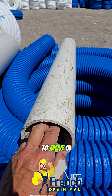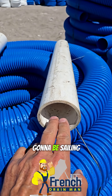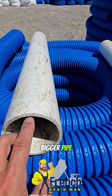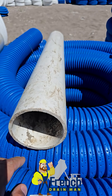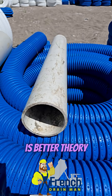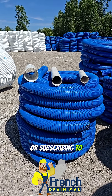If I don't have enough water to move in a four inch pipe, I go down to a three inch pipe. I want to fill that three inch pipe so the water is sailing through the center area where there's no contact with the wall. When you go to a bigger pipe, you increase the pipe wall area, so you better have enough water to fill that pipe nearly entirely so it's moving efficiently. The bigger is better theory — I'm not subscribing to that.